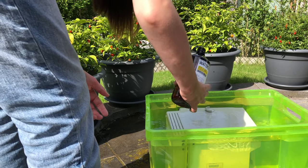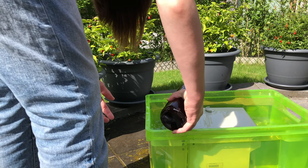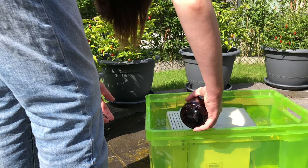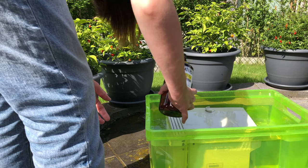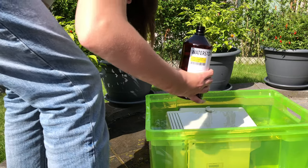If you don't massage or move the cream enough every 30 minutes or so, you could get a streaking effect in the plastic. Now, I'm not particularly interested in dark and lighter spots or streaks on my plastic. I also have to check on the pieces and turn the plastic container around once every 30 minutes or so, but I think that this is the safest and easiest option.